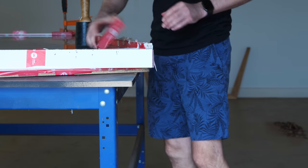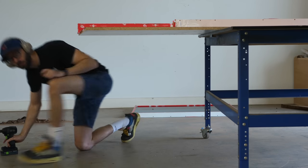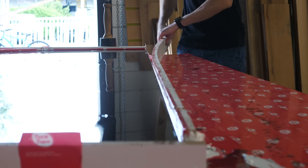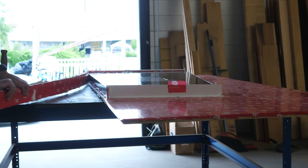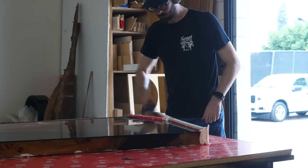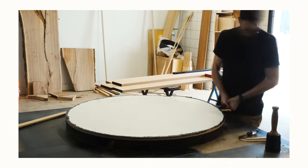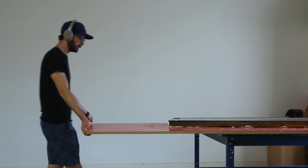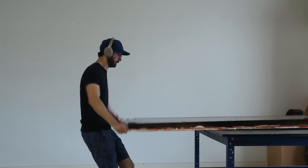Pro tip: you might be wondering why I covered an entire 4x8 sheet of melamine and tape if I was only pouring epoxy on a slab that took up a fraction of the sheet. The main reason is that my goal is to use the same sheet for several consecutive projects — if I cut it, I can only use the chunk on a project small enough to fit. Another reason: whenever you're trying to remove a slab, the sides come off pretty easily but it's hard to remove the base. You'll see people using crowbars and wedges. But if you have a large overhang like this, you can just kind of pop-release it, which is really easy and satisfying — and you end up with a sheet you can keep using.